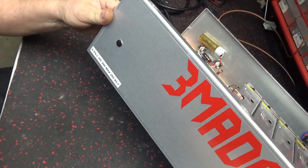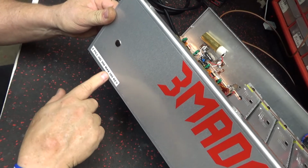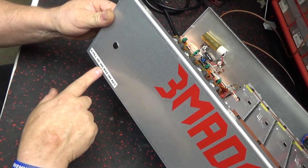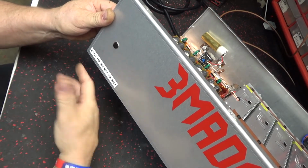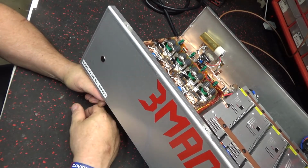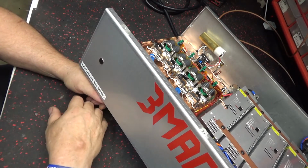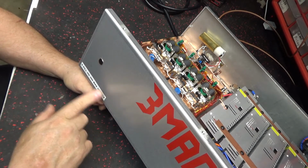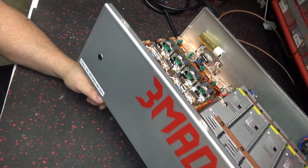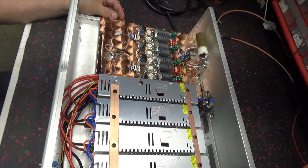I put a little tag on the front of it. 8-pill high drive. No more than 300 watts max peak, and dead key, 200 watts. That's what this means. It's an 8-pill high drive. 300 watts max, like 2-pill, 2290, 2879, but turn that down, or have something like a Cobra 2000, or stock Cobra, going into a 2879 box with variable power, and you get about 325 or something like that. 325 wouldn't be too much, but an external amp will drive it harder, like I said. But this is ready to go.